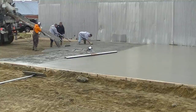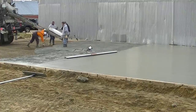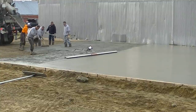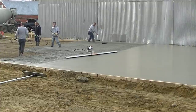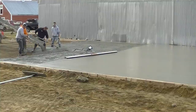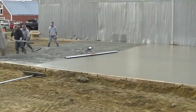You can see me right there checking the grade, making sure the guys are getting it close. We're constantly pulling the wire up — we couldn't put anything under the wire because we were backing the trucks in. Even though we walk back on it, the wire doesn't go all the way back down to the dirt; there's always concrete that stays under the wire because of the aggregate. The compaction on this was pretty much 100 percent — this thing isn't going to go anywhere. It's eight inches thick and he's going to be driving farm machinery on this.